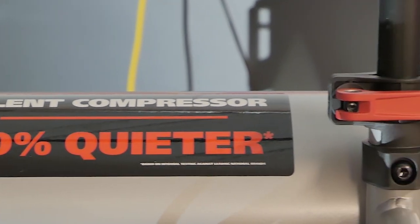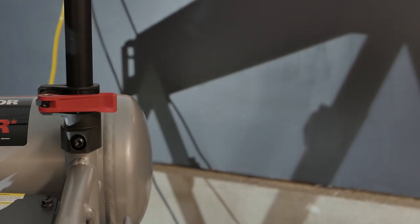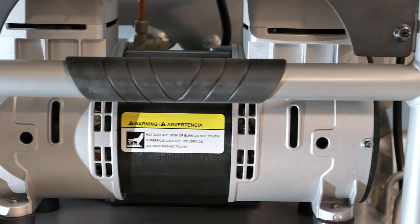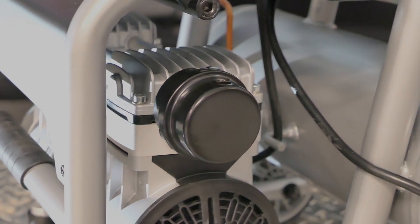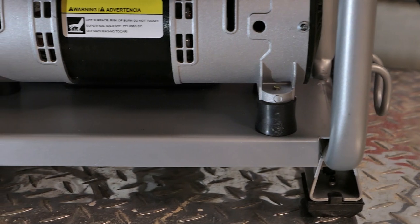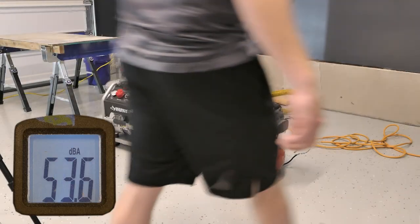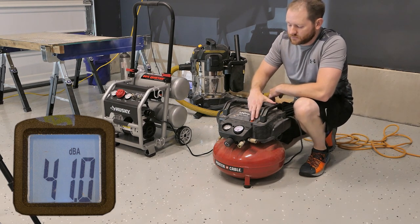Its claim of being silent. Well, we know that's obviously a marketing term, but the actual figure of 80% quieter is given. To be honest, I'm not exactly sure how they accomplished this massive noise reduction. The general design of a single motor powering two small compressors mimics what California Air Tools has been doing for years, so maybe a patent expired. On the right hand side of the unit, we see a muffler on the exhaust, so that probably helps a little. As does the fact the entire motor assembly is vibration isolated from the frame by four large rubber bushings.